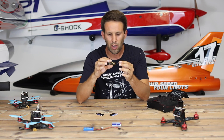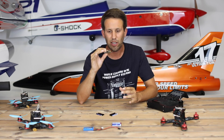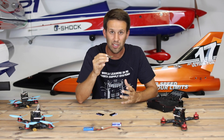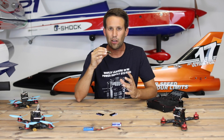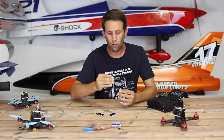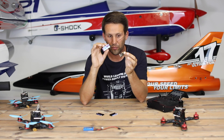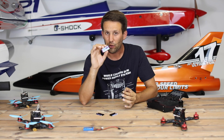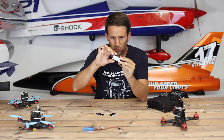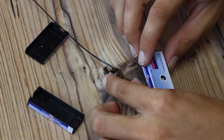Because I've taken it out of its case, I could connect the battery in either direction — but of course one of those would have reverse polarity. In order to prevent that, I'm going to compare the board to another receiver identical to how this started off this morning, to make sure I don't do that. With a couple of reference points, the antenna is sort of towards the bottom, like so.